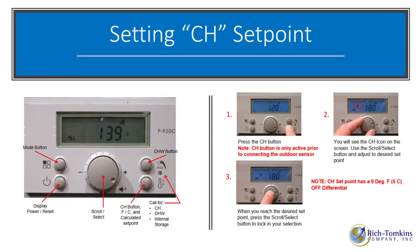There are two power buttons on the Brute FT. One is just below the main circuit board and controls power to the unit itself. A second power button on the display toggles the display on and off. If you toggle off the display button without toggling off main power, be careful — there is still line voltage within the boiler chassis.